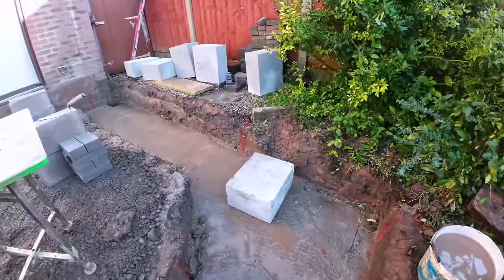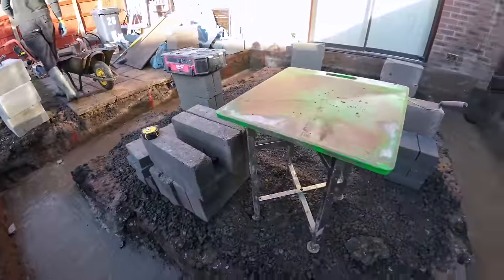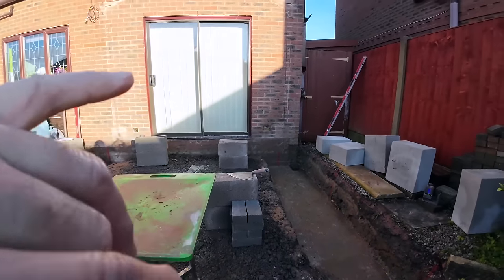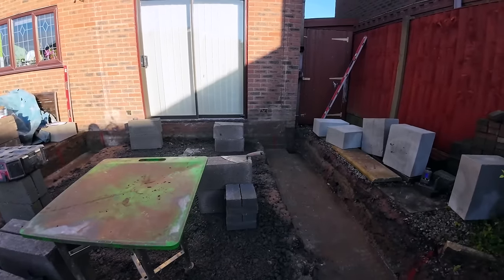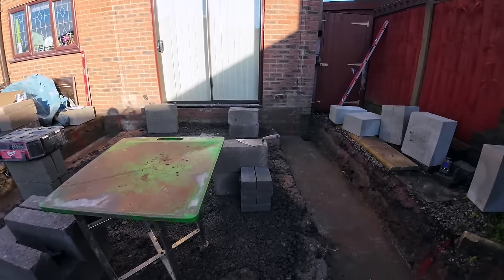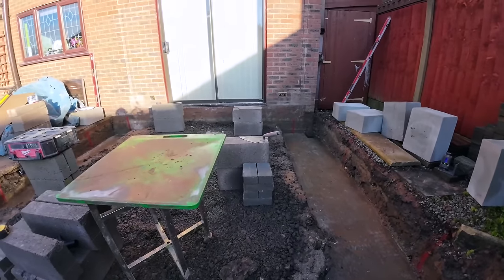Right, about 2 hours later than I was hoping, but we set out, we loaded mixes in, and we're ready to go. What we've done is we've extended it to 3.7 on the width, pinch 50 mm each side, so that means the internal, they're not losing anything because of the extra big cavity. It's four meters projection, so we don't have to do anything with that.